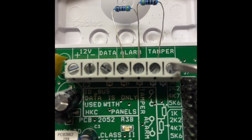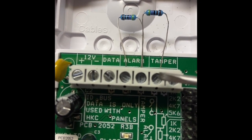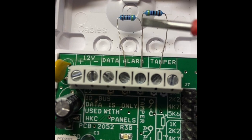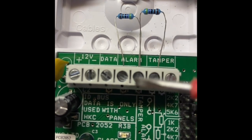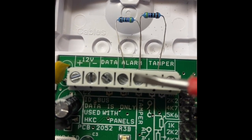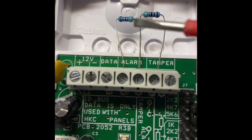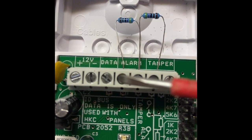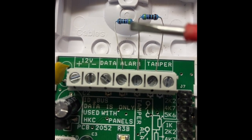You would wire one wire to the open side of this tamper. When the lid goes on, it puts a short across that tamper. Then power comes all the way through this resistor — all the way down into the alarm. If the alarm is open circuit, picking something up, the power wouldn't be able to go across that switch because it would be open circuit. It would then go around the resistor into the wire next to it and then back to the panel.